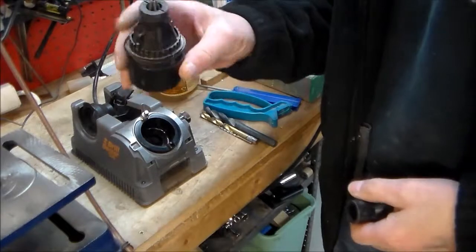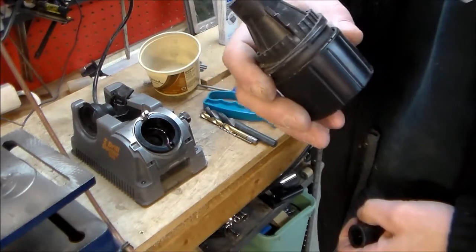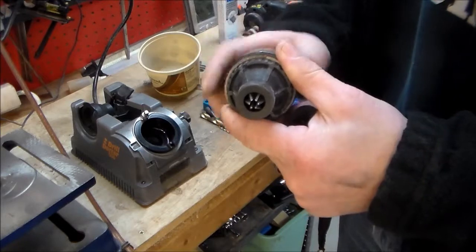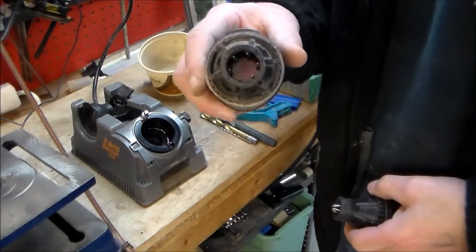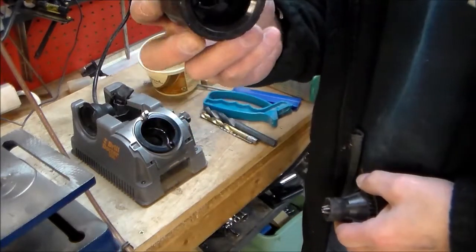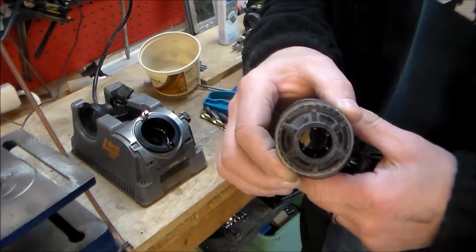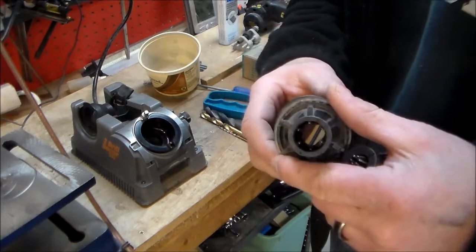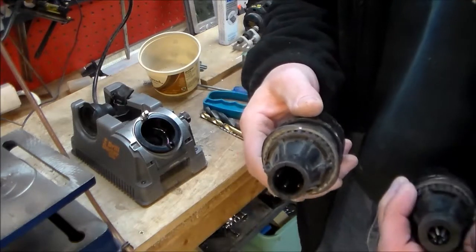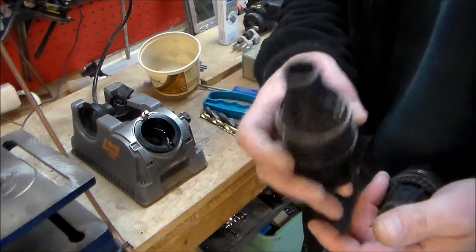The tool normally comes with one collet, useful for doing smaller drills up to half an inch. It's an expandable collet that adjusts to fit whatever drill you want to use. They also have an optional collet for half-inch to three-quarter-inch drills, which I found to be absolutely indispensable. I frequently use 9/16th drills, and sharpening by hand was always hit or miss, so I highly recommend it. Drills over half an inch cost ten bucks plus, so it's certainly worth it.